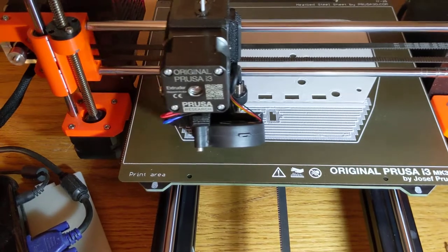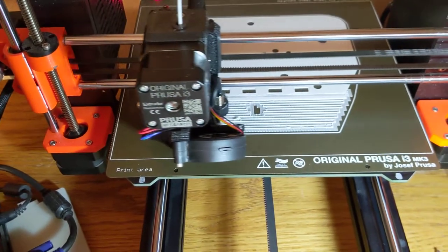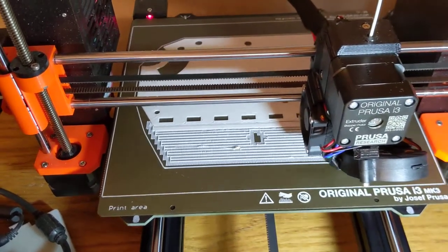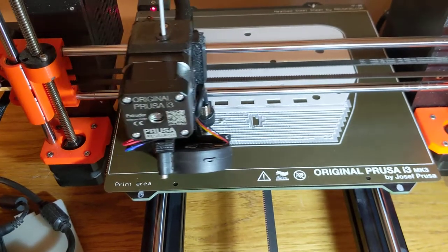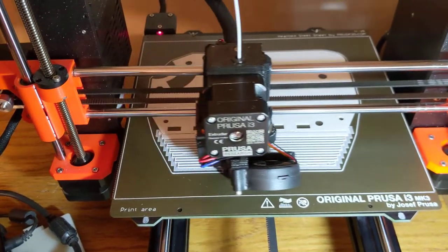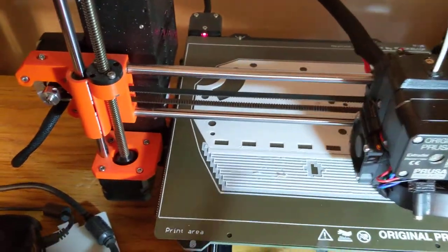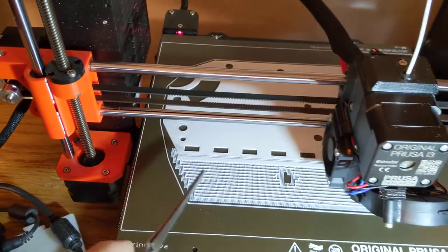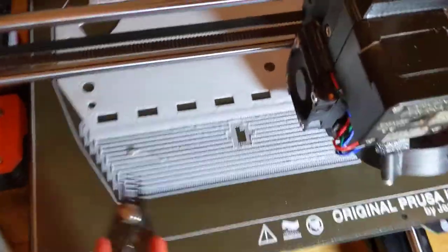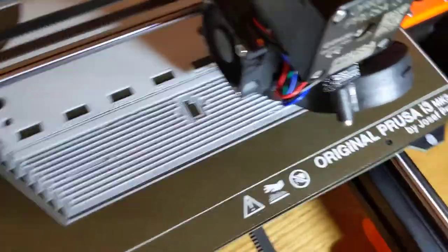Here we go with the support material — this is my biggest fear. There goes a giant blob on the support material. The support material is really thin, and now it's just going to run over that. So that's going to be my main issue right now. I'm going to have to cut that blob off. Maybe it'll knock it loose. Okay, well, I've got the blob loose — so again, I still have to babysit it because of that support material. I cut off that whole layer of the support material, so that might be an issue the next time it goes around.